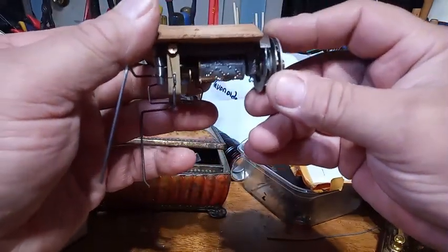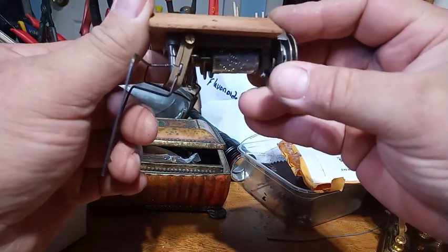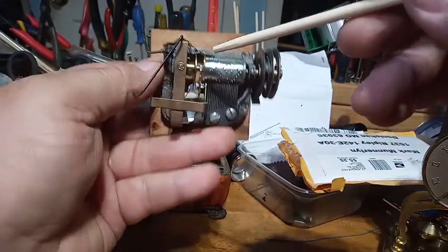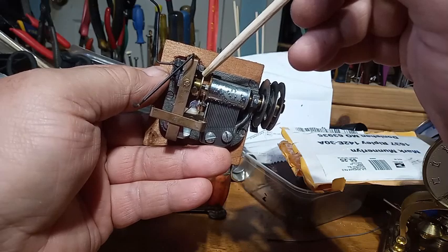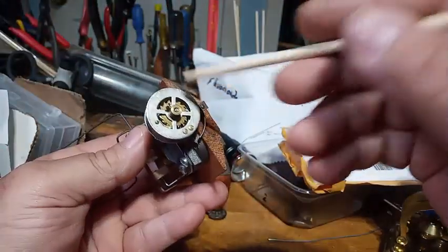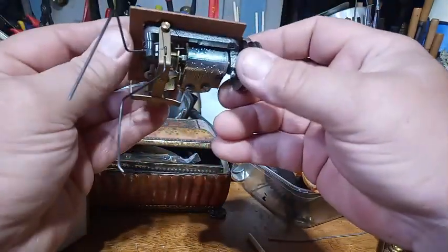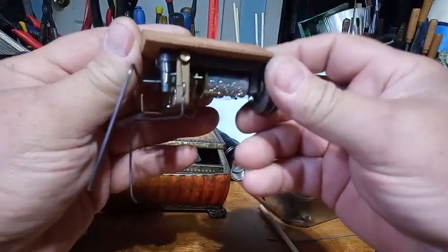If I was to put pressure on the music box — whenever the bird comes back in, that's when the music plays. The little man comes out the door because this lever goes outside the cam. There's a slot; it's a wheel with a V in it. That lever goes into that V, which allows the little man to come back inside the door. But right now it's on the outside of the wheel, which allows the little man to go outside the door.